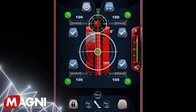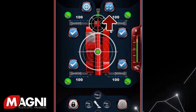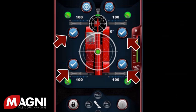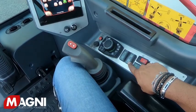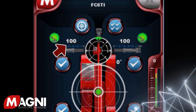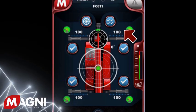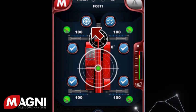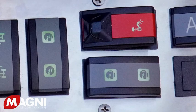Moving to the middle section, next to each tire is a button with a single checkmark. If you want to operate a single outrigger, use the four checkmarks button on top to turn them all off and then press the appropriate button to turn on the one you want to activate. Once you've made your selection of which outriggers you'd like to deploy, you will use the rocker switch located on the right side control panel to extend and retract. Each outrigger is equipped with a proximity reel that will illustrate what percentage your outriggers are deployed. When fully extended, you'll see 100% on the screen next to each outrigger. Once your outriggers are extended to the desired positions, push on the self-leveling bullseye button located at the top so that it is blue and circled in blue.